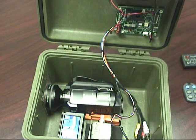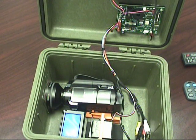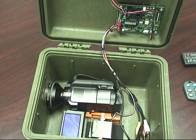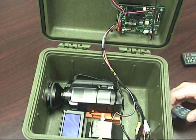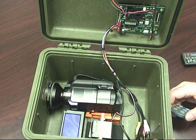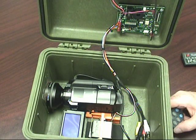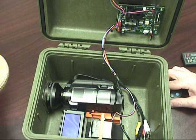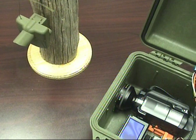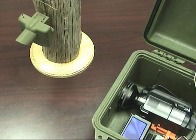With the camcorder in the off position, simply power the unit on. You'll hear the series of beeps again, and it will power the camcorder down. The system will sit in a 30-second window period to warm up. After that, you'll hear another series of beeps letting you know it's going into an auto walk test mode, which is much like the test mode we were just in. You can press the key fob to test the detection area, or activate the PIR sensor, which will give an indication back to the controller box that you have a good line of signal.